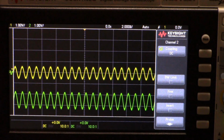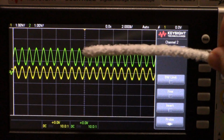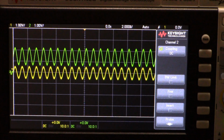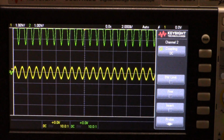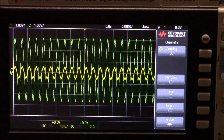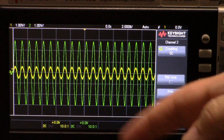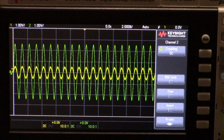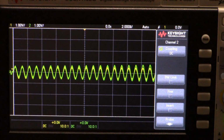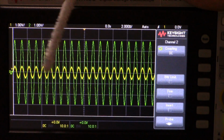If I change the bias to be above instead of below, by changing the impedance on the inverting input, then I change the volume and you can see a positive DC bias is being amplified. So turn your volume all the way to maximum, then you can impedance match by changing the resistance on your inverting input, get it looking nice and centered, and now when I change the voltage that controls the volume, it's nice and centered again. So if you're using my method of trim pots and an oscilloscope, that's how you do it. Make sure you do everything at maximum volume to center it.